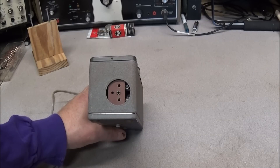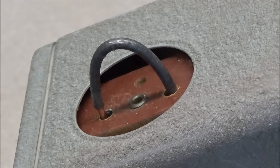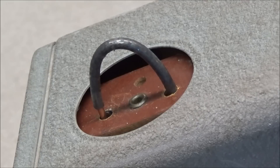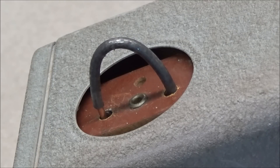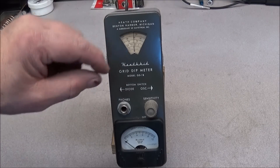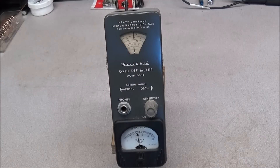So I can't do a whole lot with it without the coils. Not knowing if the meter even still works, and since I do not have the coils, I've placed a shorting wire between the two terminals — which Heathkit does have a coil like this you can use for coupling to radio transmission lines. With the shorting wire on the top, I've already turned the unit on and let the tube warm up a few minutes. When we turn the sensitivity up, we should get a deflection on the meter. And there we go — the meter is coming up, so the circuit is working.